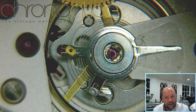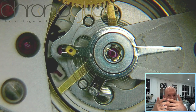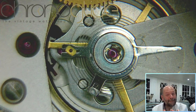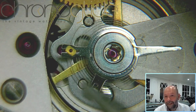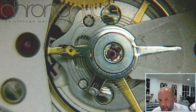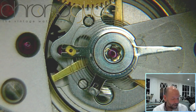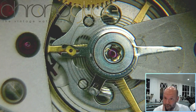There are only two ways to affect the rate of a watch movement, because the rest are gear ratios and you cannot change those for timing purposes. All the timing is done by changing the effective length of your balance spring. There is a second way of timing a watch — by the weights in the balance ring — but here it's just the timing pins of the balance spring.